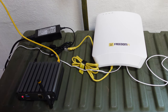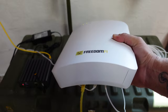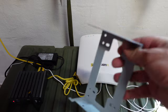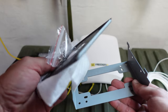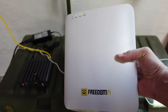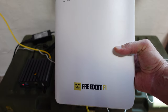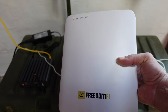Now that the gateway is set up and online, the next thing is to set up the 5G unit — the CBRS radio. This isn't the permanent location; I'm going to mount it using the mounting brackets that come with both the gateway and the radio, to make it easier to mount on the wall, give more space, help it cool better, and allow better placement closer to my external antenna.